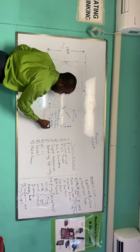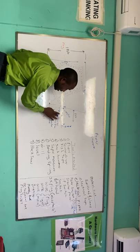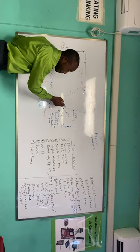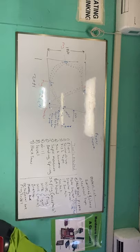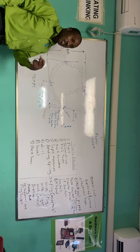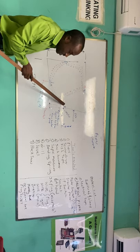The main breaker in the panel — the size meter socket that you decide to use, in terms of the amp rating, must be greater than or equal to the main breaker size in your panel. Why must the meter socket be greater than or equal to the main breaker? Because you don't want a case where you are pulling 120 amps from your distribution panel but your meter socket is rated at only 100 amp. Over time, temperatures will increase, insulation will break down, and that's a fire hazard.